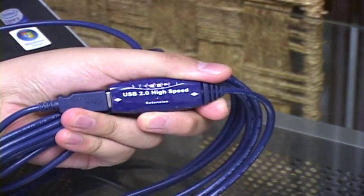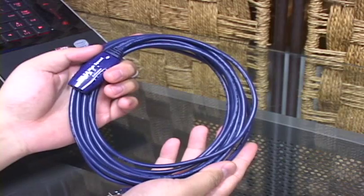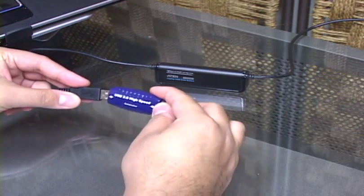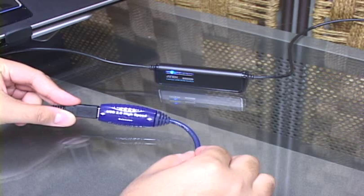The function of each end is clearly marked on the USB plug itself, though we wish that Atten had also marked the end of the device, just to make things a little easier. Just for fun, we tested the CS661 with two 15-foot USB 2.0 powered extender cables. It worked, but such a practice isn't recommended, since you'll be close to overdrawing the total power available on the USB 2.0 bus.